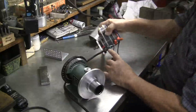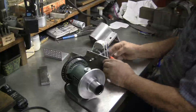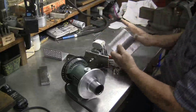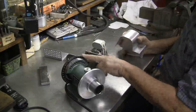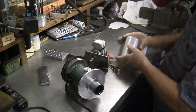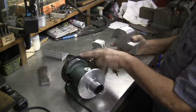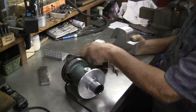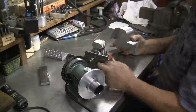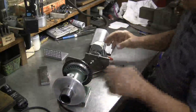On the back side you tie a knot so the electric wire won't pull out, and there's an on/off switch. Originally I showed the bracket as four and a quarter wide, but I ended up having to beat it in a little bit — you can see where it's dented. It was just barely touching the disc on the ratchet angle; I guess by the time you're done welding it swelled out by a few thousandths. Sometimes I take the index disc off so I can see better, especially if I've got more than one part to do or a part where I'm grinding up close to the collet. You don't need the indexing disc when you're using it on the surface grinder.